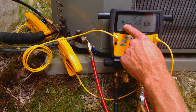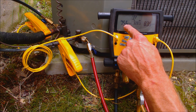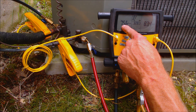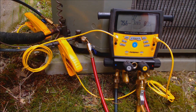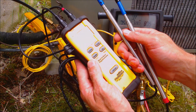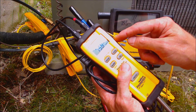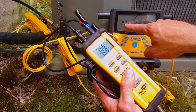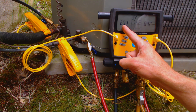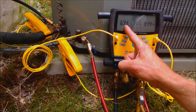If you do end up having to set this in manually, you constantly need to recheck what the indoor wet bulb temperature is, because you'll need to lower it as the system runs — your wet bulb inside the house is going to continue to fall. That's what's so nice about the induct dual psychrometer, the SDP-2. Let's go ahead and take the digital psychrometer inside the house and see what the indoor wet bulb temperature is now — we have a wirelessly transmitted wet bulb temperature of 63.4 degrees.